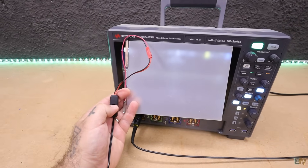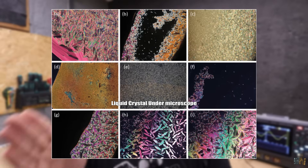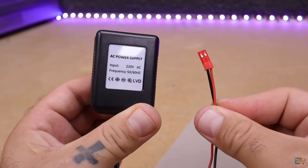Why do we do that? Basically because the crystals are quite fragile. You could use DC if you want, but if you apply DC voltage to this film, all the crystals will align to that direction. The problem is, imagine you use this for hours — maybe one full day. All the crystals will be in the same position for an entire day. That could damage the crystals and create a ghosting effect where the crystals stay in the same direction even after you remove voltage. That's why we use AC signals, the same as in the LCD. We switch the signal on and off very fast so the naked eye won't see it, creating a blurry effect, but the crystals won't stay in the same position forever. That's why we use AC — to switch signals to the crystals rather than applying a steady DC voltage.